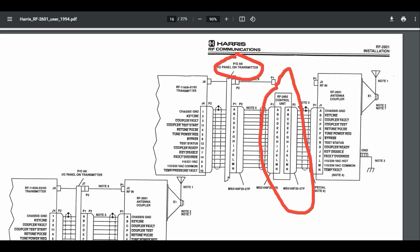So what I decided to do is, as I've done in many other videos, I've decided to use standard CAT5 and RJ45 cables and connectors. In all my other cases, whether it was audio routing or key lines, the eight conductors in one CAT5 cable was plenty. In this case I need two cables, and I'll show you how I do that. Plus, instead of using the AC source from the transmitter itself, I'm going to make an AC plug into this. The reason is I don't want to have to always use this transmitter to run the coupler and the unit. I want to be able to make this work with other transmitters, and to do that I'd have to be able to provide AC even when this transmitter is not in use.